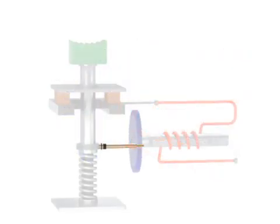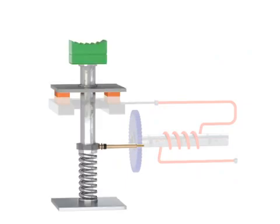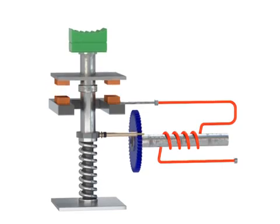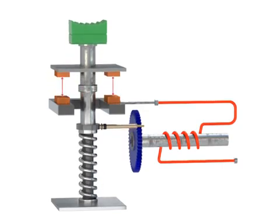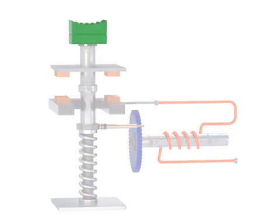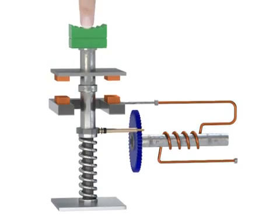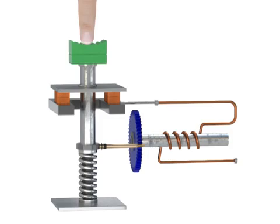This pawl is connected to a spring-loaded contact fixture, such that when the pawl trips, the contacts automatically open and stops the current flowing to the motor starter. The spring-loaded contact fixture also includes a reset button so that when the eutectic alloy cools and cements the ratchet in place, the contacts can be closed by re-engaging the pawl in a cog and compressing the spring.